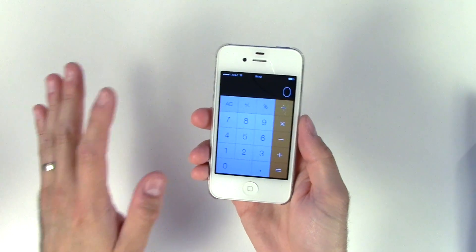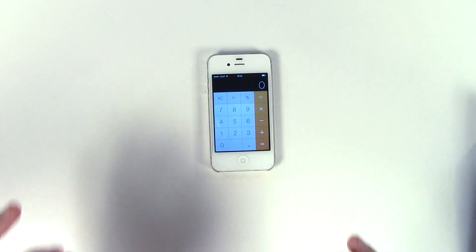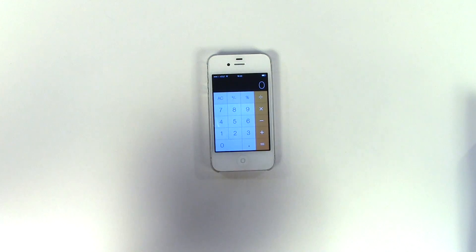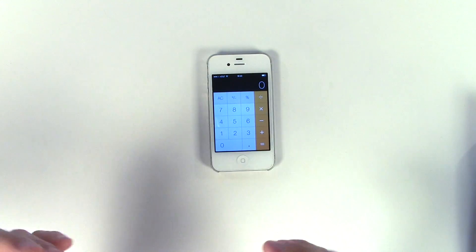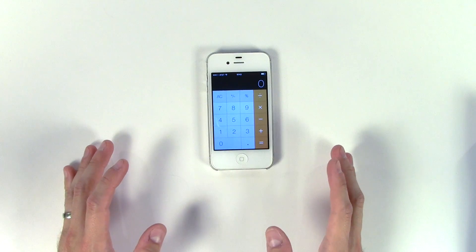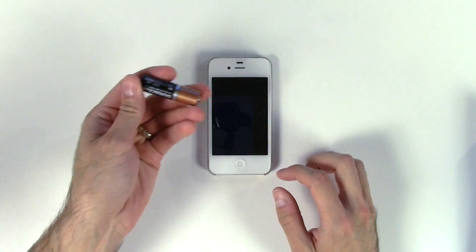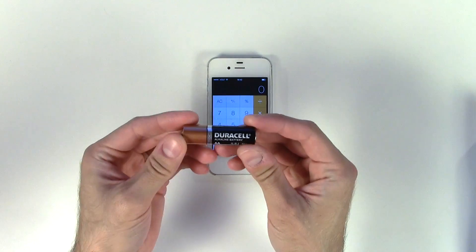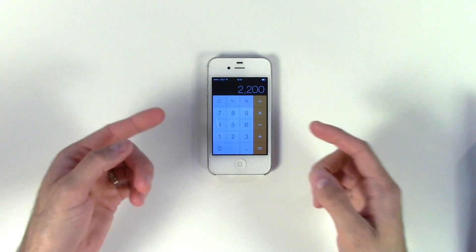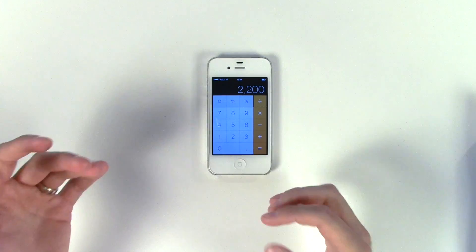So what can we do with that 100 milliamps number? Let's get out a calculator and do some math — don't worry, it's not too complicated. I do need to include a caveat: this is very rough math, by no means precise or accurate. Trying to calculate battery life is not cookie-cutter; you really need to know the intricacies of the device and the batteries to get any accurate number. The standard Duracell AA batteries I'm using have a milliamp-hour rating of 2200.